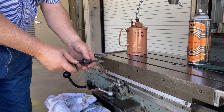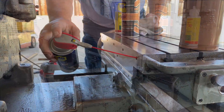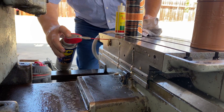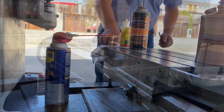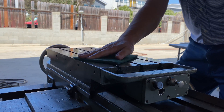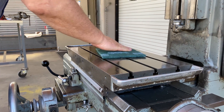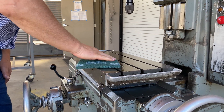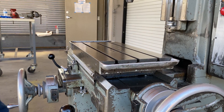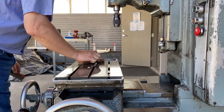I'm cleaning up the table here. As we get new equipment we like to clean it up and make sure all the surfaces are straight and clean, so we can augment the table and make sure everything is well maintained and can function properly. We're taking care of the table surface here and getting it all clean. You can see the oiler in the front right that oils the ways. That black knob sticking out on your left is to lock the X and Y axis — one for X and one for Y.